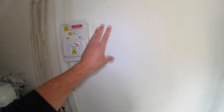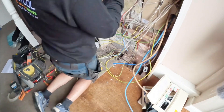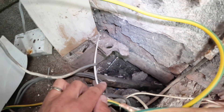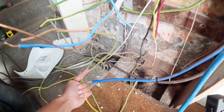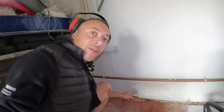That'll get us under the floor as far over this way as possible, because what I want to achieve is to go straight up and that should get us to around about where our consumer unit is going to go. My drill bit has just popped through the wall - that's just a little pilot bit to test, and now I'll make the hole wider. I can drill a couple more holes next to it so I can send these cables straight through the wall, under the floor, straight into the garage. Now I've drilled my holes down low, ready to get the cables coming through.